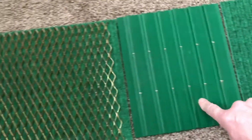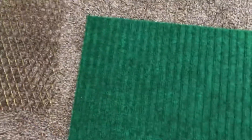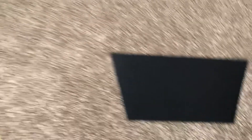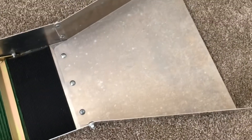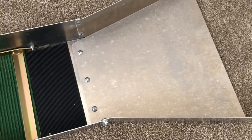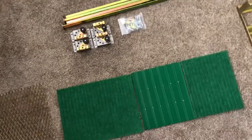The last part is the A52S riffle board, carpets, and matting — part number A52SRA. It's got the riffles, carpet, miracle matting, some expanded metal, and another piece of carpeting. I've also purchased a piece of half matting that I'm going to throw in the front of the sluice box, right in the flare section. I'm not going to do that in this video because I want to actually play with this thing today. So there's all the parts in the kits and the part numbers — I'll list all the part numbers in the description below the video.